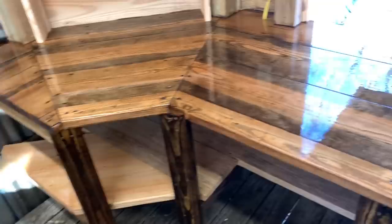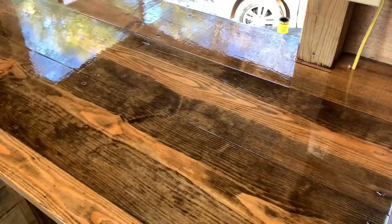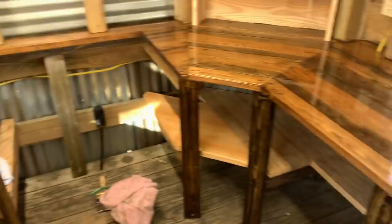Thick coats are going to take a lot longer to dry. It's easier if you can spray this stuff because you can control the material better than with a brush or roller – you're going to have spots where it's piled up. If I go back and brush it now, all I'm going to do is leave streaks and lines because with the humidity low like this, it's drying out fast, it's tacking up fast. So you need to do it and then get off of it – you don't want to keep brushing because you'll leave bubbles and streaks and dry spots. Every coat you try to make as uniform as possible, and spraying is better – you can just do a better job with a spray gun. But a brush works too.